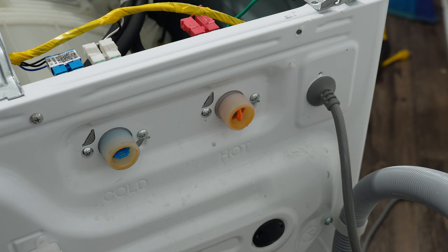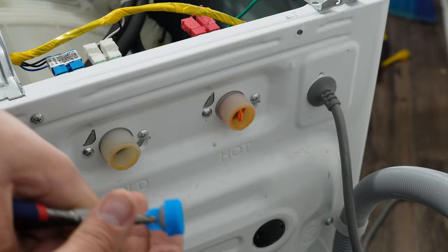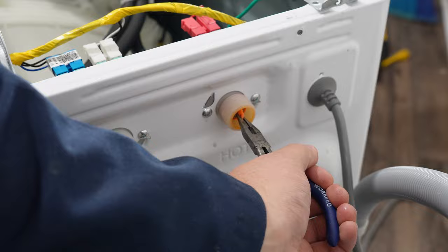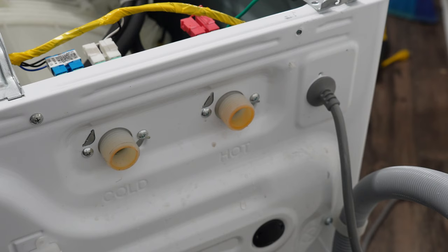If you know that the valve hoses have been installed to the proper sides correctly, the next step would be to take a pair of needle-nose pliers and remove the valve screens hidden on the inside of each of the valves. You should be able to see clearly through the valves, and they would be free of debris. If not, these screens could be clogged, causing water not to flow through the valves properly, which could give you the error code. You can simply wash them off, but if you find they are damaged or compromised with holes in the screens, you absolutely want to buy and replace them immediately. I do have a link to brand new water valve screens in the description through Amazon.